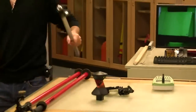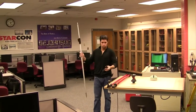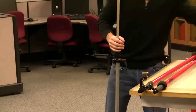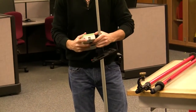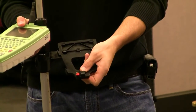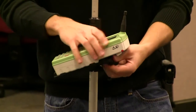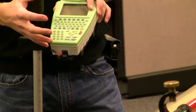Next, we have our prism pole. First, make sure the bracket is connected for the remote — slide it down to the bottom. Adjust it to a height where you don't have glare and it's easier to view. When you put the remote on the bracket, there's a silver retainer clip — it's a spring-loaded clip — that has to go onto the bottom of the bracket where there's a hook. Put the clip on there and make sure the remote goes forward and clips back so it doesn't come off. There's also a safety red button here — make sure it presses up so the remote is secure.